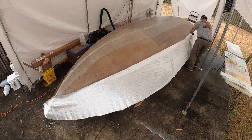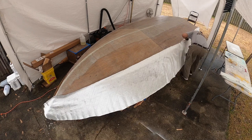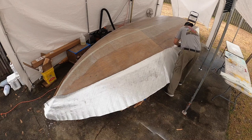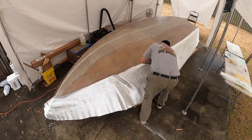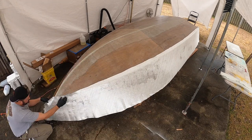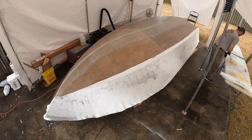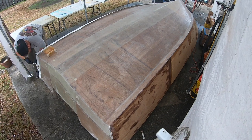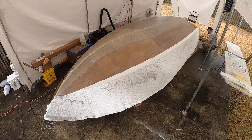Right there on the very point you can see that line - my reference point. I have reference marks every foot on the bottom of the hull that I put in when I fit all this stuff. All I'm trying to do is line that up, then push the glass down, laying it out from the transom to the bow. That line lines up perfect, so now I don't have to worry about the orientation of the fiberglass - it's exactly where it's supposed to be.